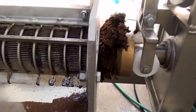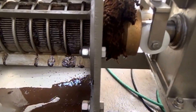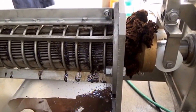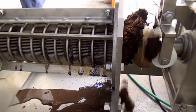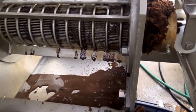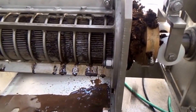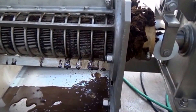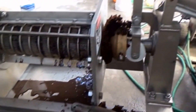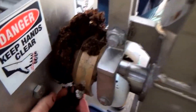If this were blueberry juice, it would be worthwhile — we'd get enough juice out to make it worthwhile. But we're not getting out enough water here to pay for this screw press. We're keeping the press full and getting some flow of liquid, but it's a small percentage compared to the weight. We're not getting a great deal of water, and moisture content is probably not being reduced much.